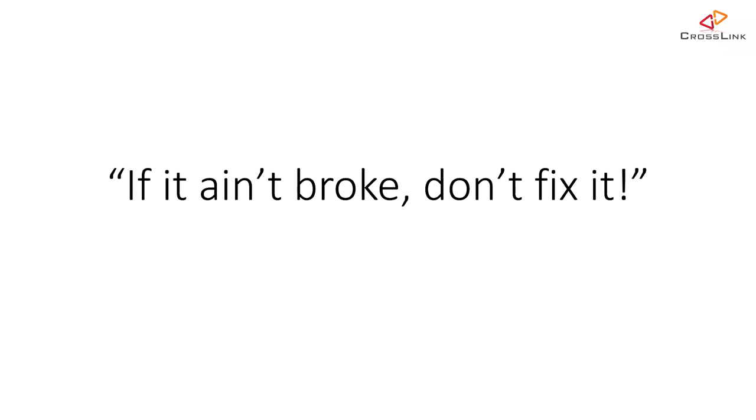So in general, you see there are pros and cons and quite some things to consider, but in general, Marlin 2.0 is where the community is heading. So we should all be aware of the implications, be it we will have to upgrade our mainboards at some point in the future, or we will have to stay with what we have. But that can also be totally fine. If you have a printer that is working fine and is producing great results, probably better don't change that.